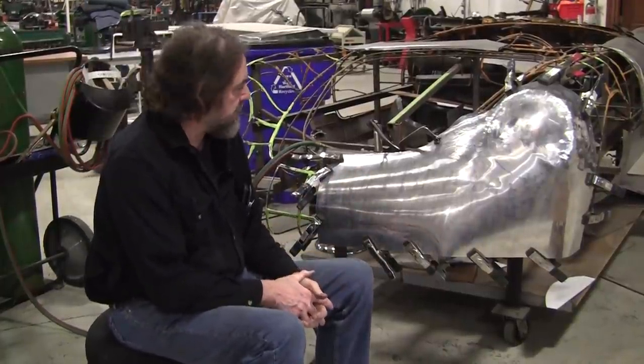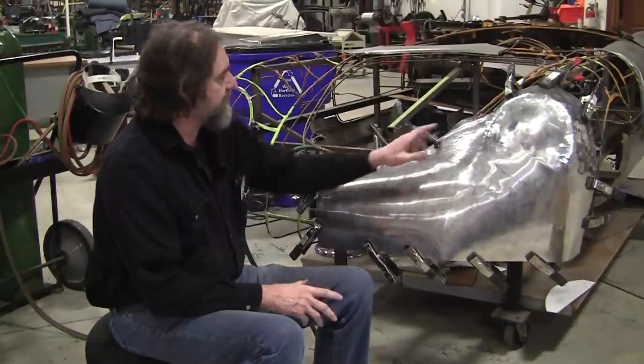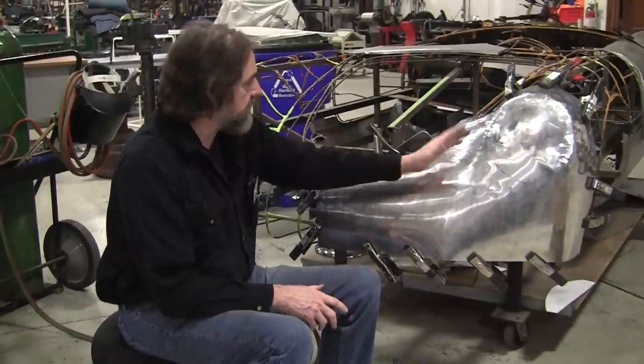We've got two installments in and out. It's the third installment, and it's fitting pretty good, except for this spot here. We did do some internal shrinking to help the reverse curve, but obviously it's not enough. So how are we going to solve that problem?